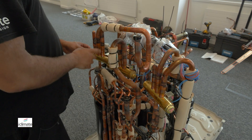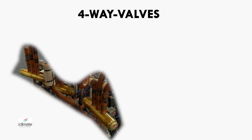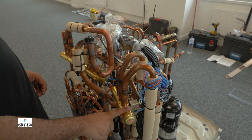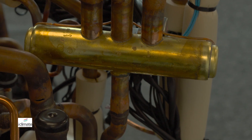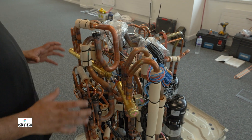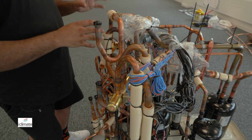Let's talk about the control side. The first main components are the large brass cylinders — these are what we call four-way valves, controlled by solenoids here. The job of the four-way valve is to divert refrigerant to the right set of pipework according to the mode the unit is in. This is a very special unit — typical air conditioners have one four-way valve because they have one condenser and can only be in one mode of operation at a time. This is a simultaneous heating and cooling version, so the heat exchanger has an upper heat exchanger that wraps around and a lower heat exchanger. Every heat exchanger must have a four-way valve so it can accept a different state of refrigerant — that's essential for simultaneous heat recovery heating and cooling.